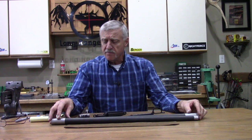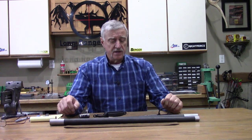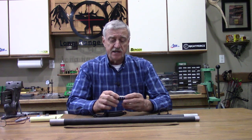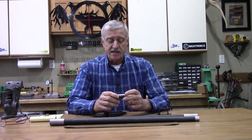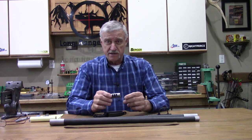That covers the Christensen Arms barrels — I ordered two identical blanks because I always need another barrel blank around. I'll drop in some pictures of the muzzle brake so you can see how the Slayer brake goes. I've used this brake a lot and I'm very fond of it. There are four ports on the top — you can remove these plugs to control your muzzle rise. The first port catches most of the blast and does the most work. On a .30 caliber, I'll probably open the first and third, or the first and fourth, to get just the right amount of muzzle rise control so I can stay on target.